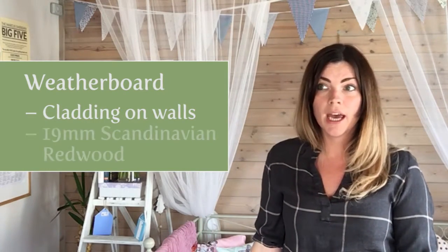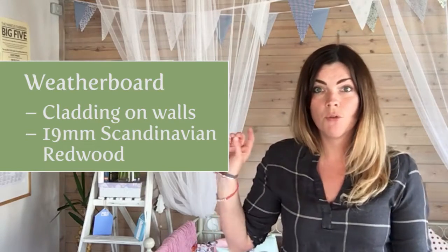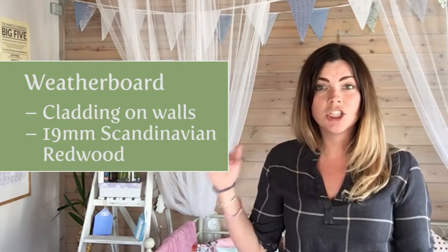We use a 19mm Scandinavian Redwood cladding, and it's a tongue and groove weatherboarded shaped profile. There's lots of different alternatives for cladding your building. However, we find in Scotland that one is the most durable against the rain.